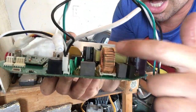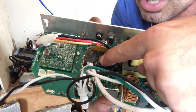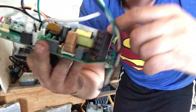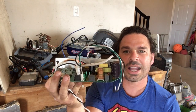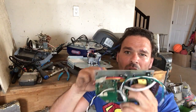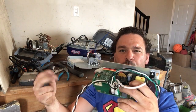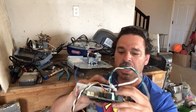You also have right here what I call copper donuts, as well as a small transformer. There are a couple nice relay boxes that contain a little spool of copper inside, as well as some silver. If I was to bring this circuit board to the scrapyard as-is, I only get $0.05 a pound for it regardless of what's on it. It is going to be worth a lot more money taking the time to separate the aluminum, the copper, and the transformer. Once I depopulate the board, I can still bring the remainder in and get $0.05 a pound for e-waste.